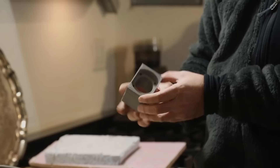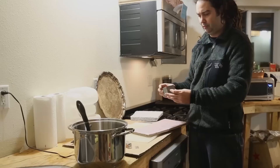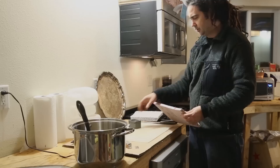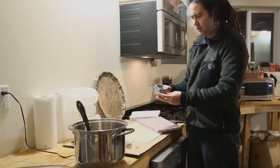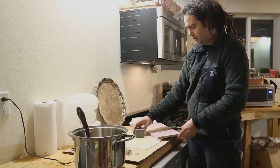So here we have our printed part. I filed it down a little bit, made it nice and smooth around the edges. What we need to do is use some styrofoam to cut ourselves a place to connect where we're going to pour in the molten metal. Those are called gates and runners. The gates actually attach to the part and will be cut off with a hacksaw. I'm going to attach on this side because I need very high tolerance on the face, and on the sides it doesn't really matter so much.